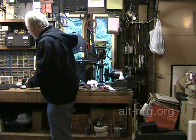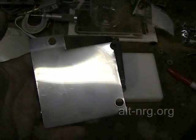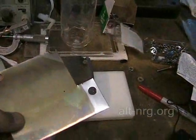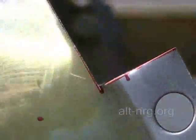I have a lot more work to do, but all of the plates are cut. I do have to tap these plates out against the vise because as I cut them with the shears, when I make the cuts along the edges, the edges start to curl just a little bit. And of course, with tight spacing, you need to have the plates flat.